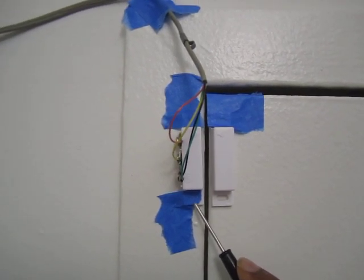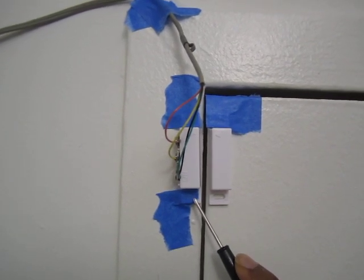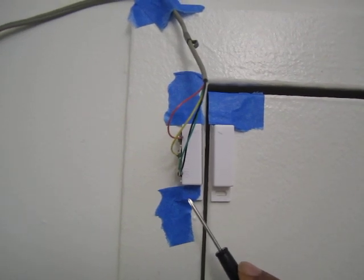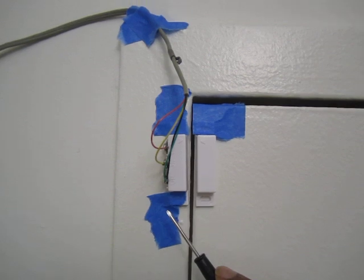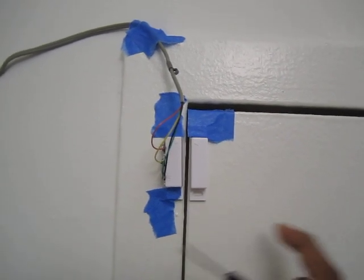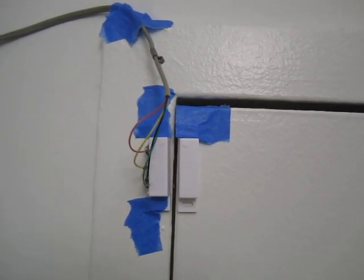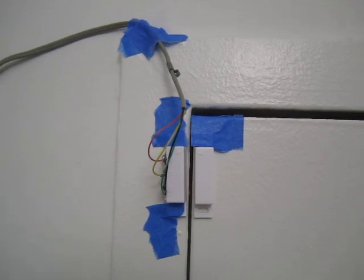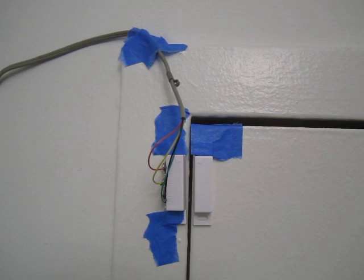And so this is the basis of a lot of security sensors, in particular for doors or windows, where some sort of action, such as opening the door or the window, will cause the sensors to move apart from each other, which can indicate to the alarm system that something interesting has happened. And potentially this is an incident that warrants some other action.